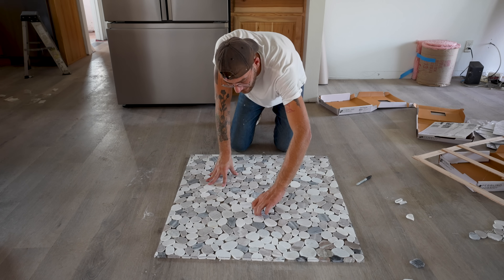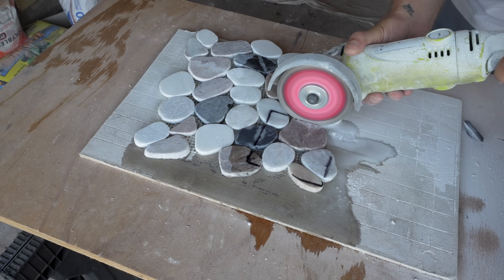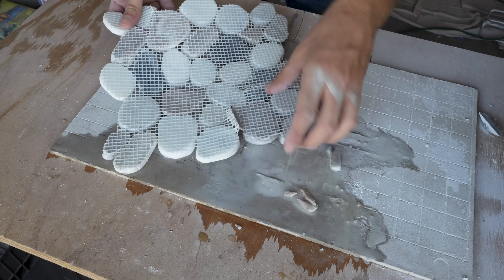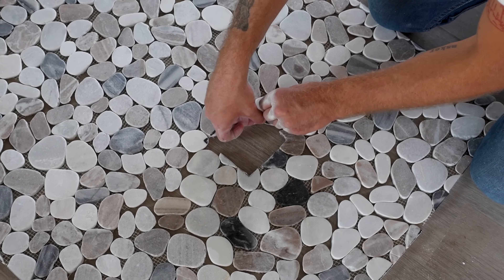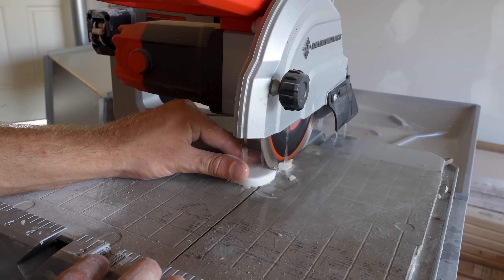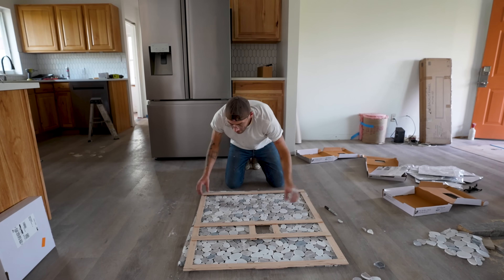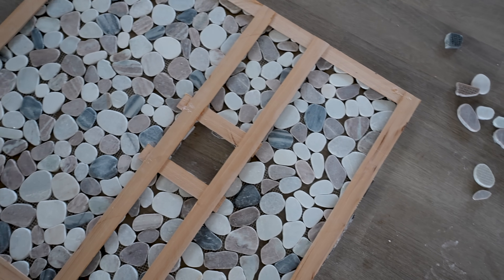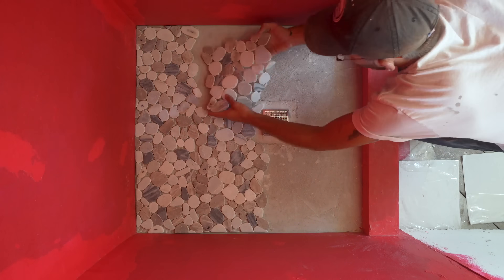Progress is going great. Now it's time to cut out the opening for the drain. I added some water to the surface of the tiles before using my angle grinder with the same diamond disc to make these cuts — the water helped keep the dust down and I think it helped the temperature stay lower because I didn't have any small pieces crack. I used a razor blade to separate a couple of individual stones overlapping with the drain, being careful to keep my fingers away from the blade. One final check and our drain is pretty much spot on, so I'm going to do a dry run laying these pieces out on the shower floor to confirm I don't need any more adjustments.